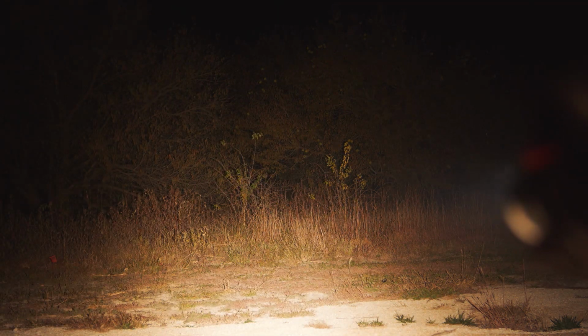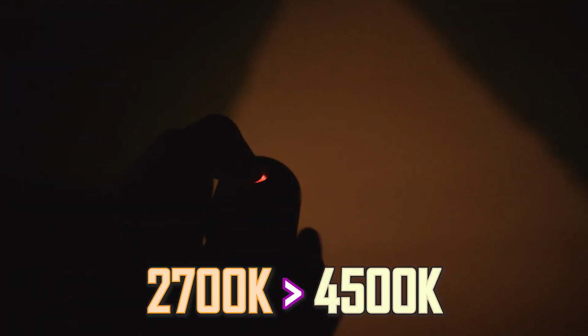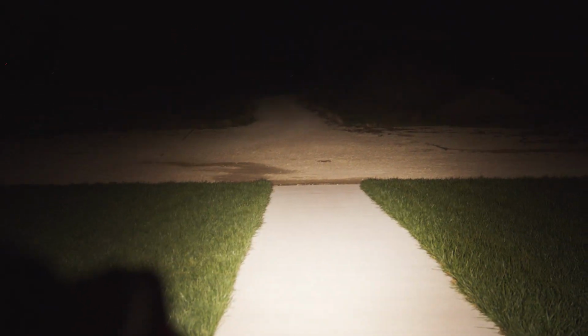This particular dual channel light has a combination of warm white and neutral white LEDs, which can be ramped to the desired temperature. Because both channels have such rosy beams, I do think that the center of the ramp is just a little too pink for my liking. It is a bit unnatural looking. This is just a result of mixing 2 different CCTs. Any tint ramping light will be rosier at its midpoint than at its endpoints.